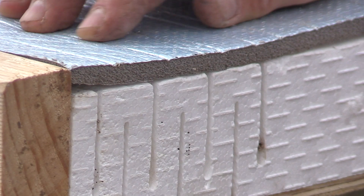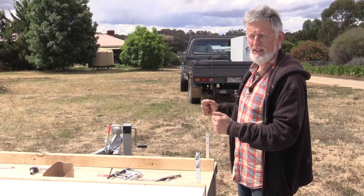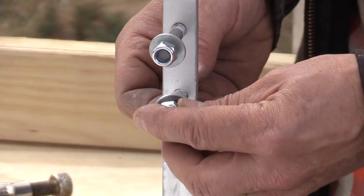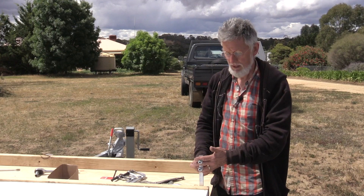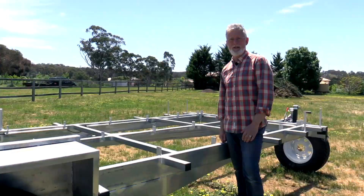Part of the unified construction method is that we're holding on to the wall. Because it's going to be vibrating, it's that upward lifting force that we want to guard against. These bolt onto the stud that goes straight up and down and rises right up to the rafter, so we bolt onto it in two places — eight all up. It's a very strong way to hold your tiny house and your trailer together. Vibrate all you want — it's not coming apart.